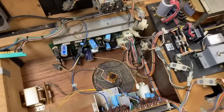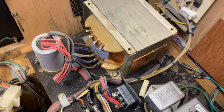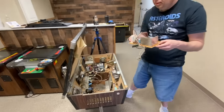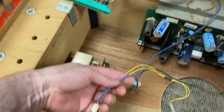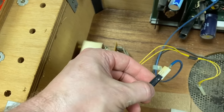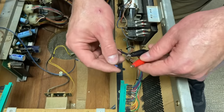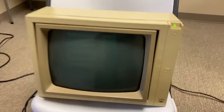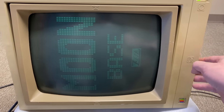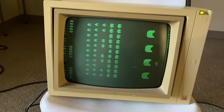After cleaning, let's take another look inside — wow, it doesn't even look like the same machine. You could actually read everything. The first thing I should do is remove the monitor board since I want to replace all the capacitors on it. It's a surprisingly small and simple board. I noticed the video connection was just two wires — I would have expected separate sync signals, but it appears to be composite. So I've plugged in a header to get the signals and do a little experiment. I've hooked up a little Apple 2 green composite monitor and powered it on — interestingly enough, there is a picture there. It's a little dark even at high brightness, but if you turn the lights out you can totally see the game playing on it just fine.